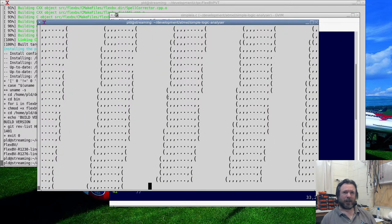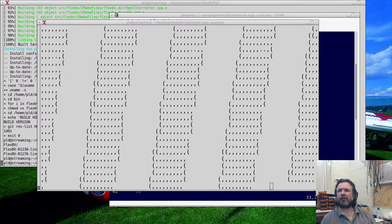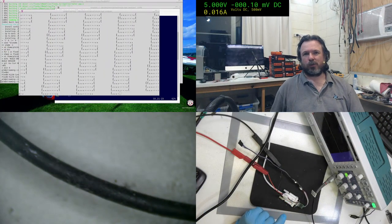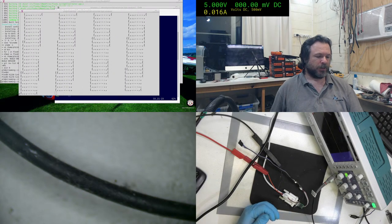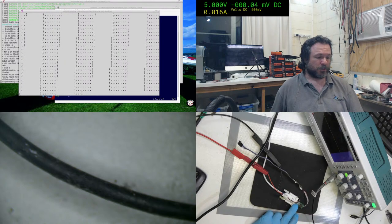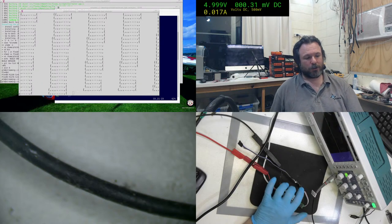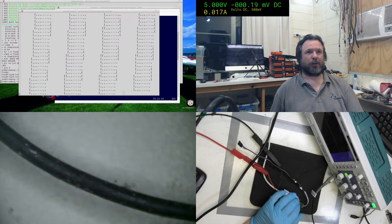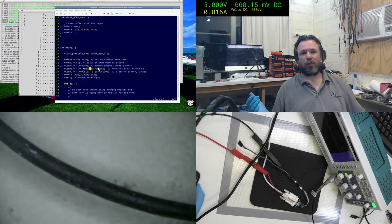I don't think it'll be because of the adapter, because I am self-powering this. Usually, what happens is with these adapters, where they fall down is when they want the much higher voltage. But funnily enough, this 202 chip I've got here will actually be boosting up to the higher voltages, so that's not going to be the problem. And also last night when we loaded the firmware on this of what it originally was made for, it works perfectly fine. So it's not the USB adapter, it's something in my I am misinterpreting what is happening.